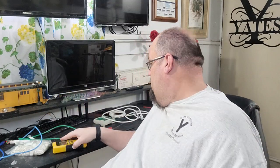They were dirt cheap so I ordered them and they seem to be okay. The difference is these were cat 7. The difference between cat 7 and cat 6 is shielding — shielding between each pair of wires. Cat 6 can come shielded, but it's an outside barrier of shielding. I have not really tested shielded cable in this tester. This is basically your tester — it has a ground that might be for shielded cable. I got this one to replace an old tester, and I wanted to show the difference.